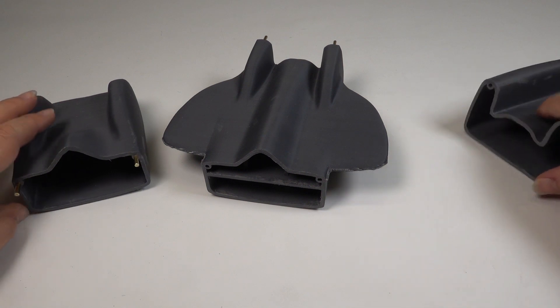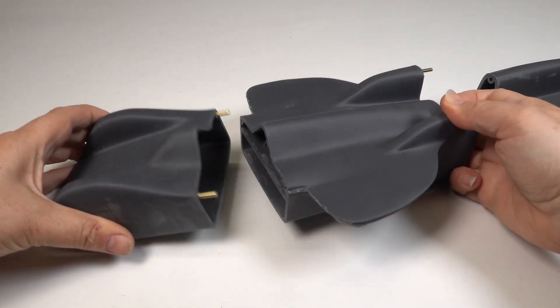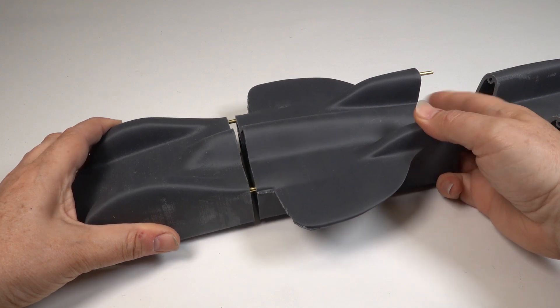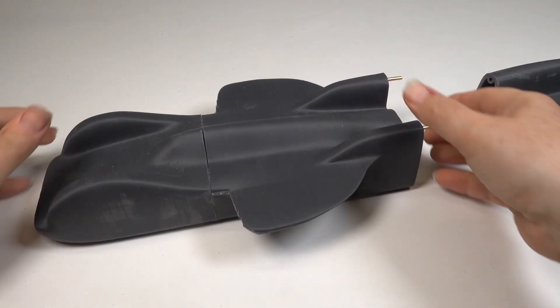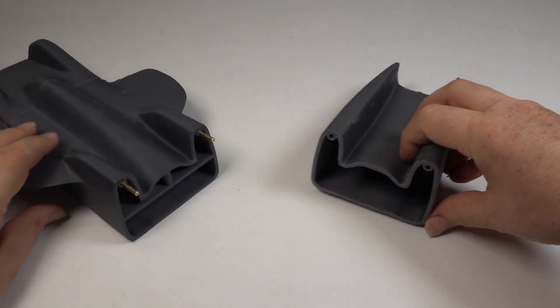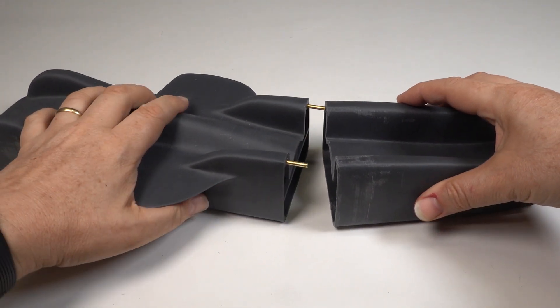The base plates have been removed from the main 3D prints and I've tidied up the mating surfaces. I designed these parts so they didn't need any support material and was very pleased just how clean and relatively smooth they were. I deliberately designed the body as a complete shell as I didn't know exactly how much of the underside needed cutting away to fit the wheels and chassis. Any holes I did make would need support material during printing anyway, which would have used almost as much plastic.